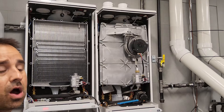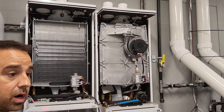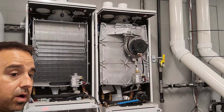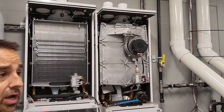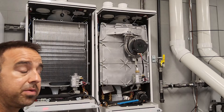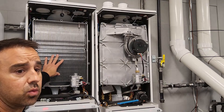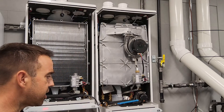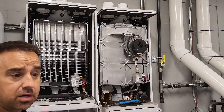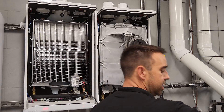If you don't have one of those tools, I definitely recommend it, especially if your heat exchanger hasn't been cleaned in five or six years. Now everybody asks: how often do I need to clean my heat exchanger? I recommend you take a look at it after the unit's first birthday, and that way you can see if it's propane and maybe you didn't do a great job at your combustion analysis, or maybe there's some flue gas recirculation coming up. At least you're going to notice it right then and there, and you can ward it off, clean it, double-check your combustion, or try to look at what is causing that contamination.